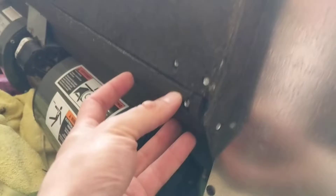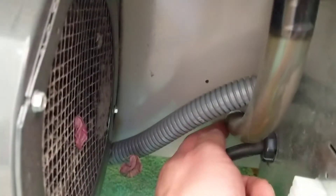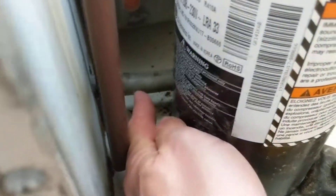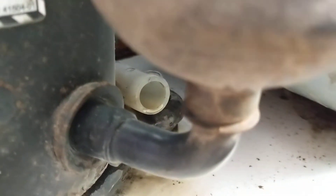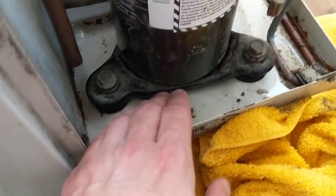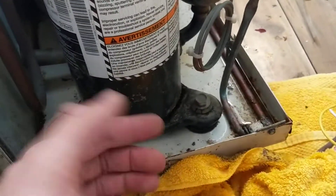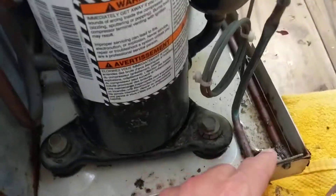As that hot air passes through here, it accumulates moisture from the air — it's condensing. That moisture falls down into this front pan. From this front pan there's a little hose, which you'll see on your unit, that goes to the back and comes out into the outside portion of the heat pump. That hose pushes water into this catch pan.